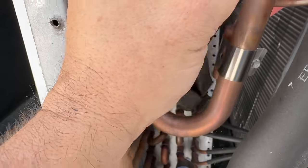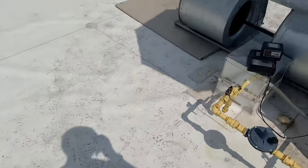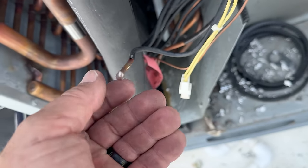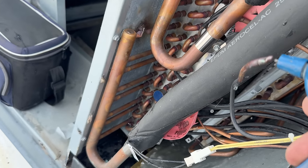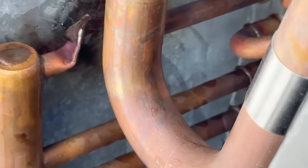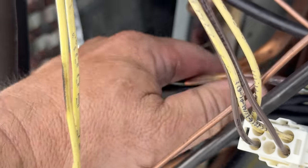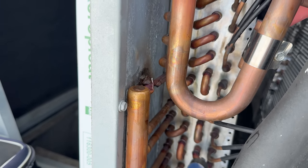Okay, so I just scanned it with that — nothing, didn't hear anything. We ended up brazing over the end of that and brazing over the end of that, which pretty much filled it in as good as you can, because at the edge corner it's real sharp — it's not like you can really suck it into the piece as well. We got 90 pounds on it, which ain't a lot, but that's all it took to find the other one. It does not appear to be bubbling. So it worked — we lost a total of five pipes going across, three-eighths. Not much more you can do with it.